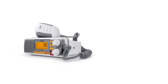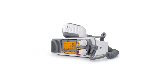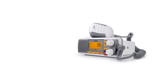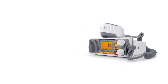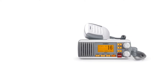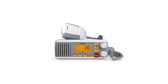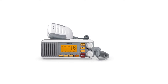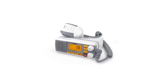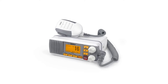One troubling aspect of the Uniden UM385 is the waterproofing — or lack thereof. With a rating of IPX4, the device can handle a little splash of water or maybe a drizzle. Depending on where they're installed, fixed-mount marine radios may not be at a big risk of getting drenched, yet there's always the risk of humidity, accidents, and several other factors when the boat is offshore. Better waterproofing is definitely desirable. Overall, the Uniden UM385 is a decent, low-priced VHF marine radio that can work well for offshore fishing, though the low cost affects available features — no AIS, needs an external GPS receiver, and the waterproofing leaves something to be desired.